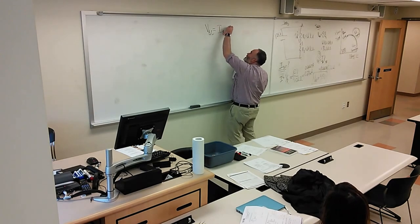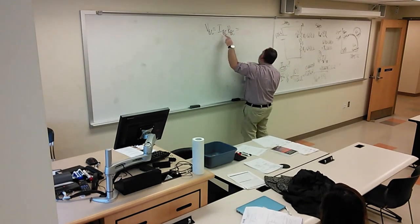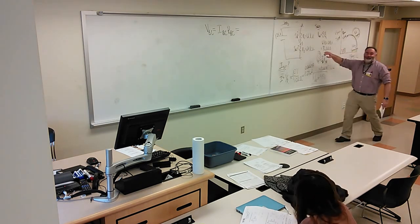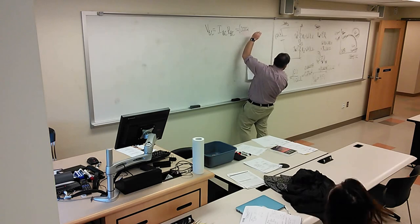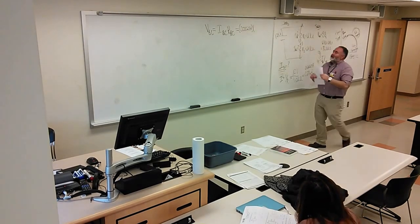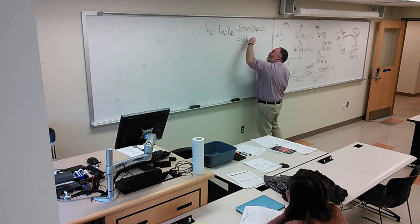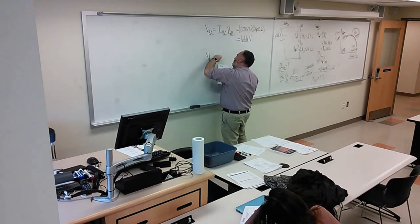Current B to C times resistance B to C. I'm going to need some values, right? What's the current B to C? We already solved this guy. What's the current B to C down here? It's the same current, right? 0.00027 amps. What's the resistance B to C? Because that's what it says. 24,000. Anybody get a number for this? 6.6.